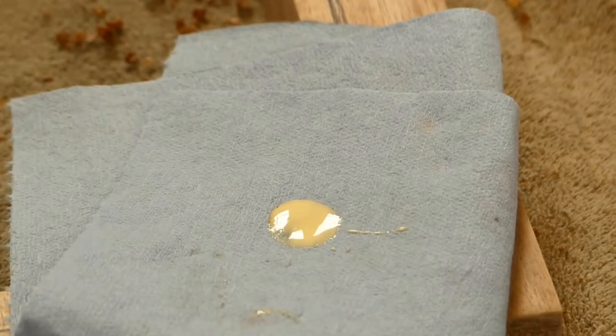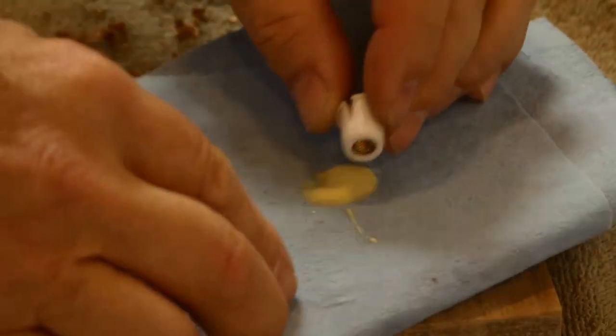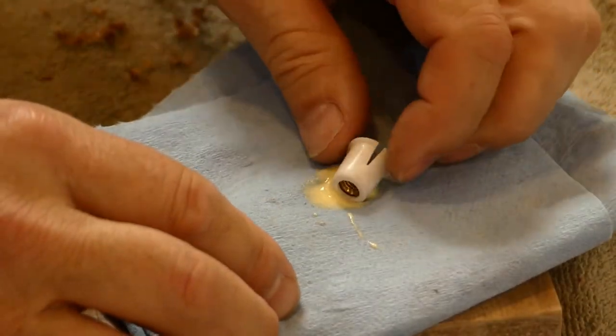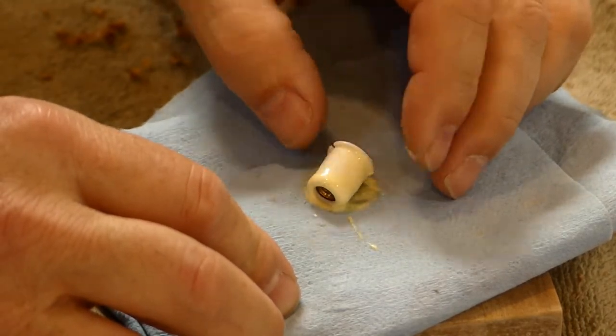The tape is being used on the drill bit so I don't drill too deeply into the underside of the counter. Here I'm using carpenter's glue to coat the plug. This worked okay, but through further experimenting I found that Gorilla Glue worked even better — try for yourself to determine what works best for you.